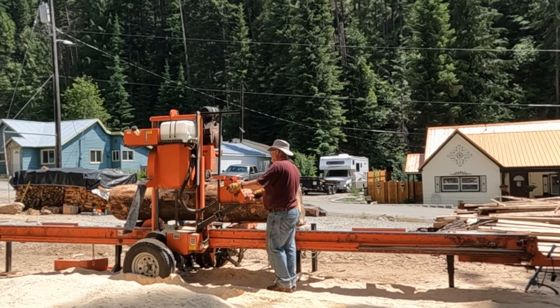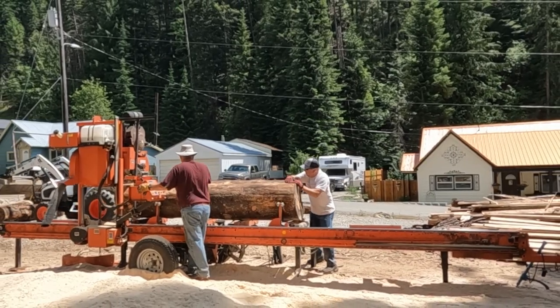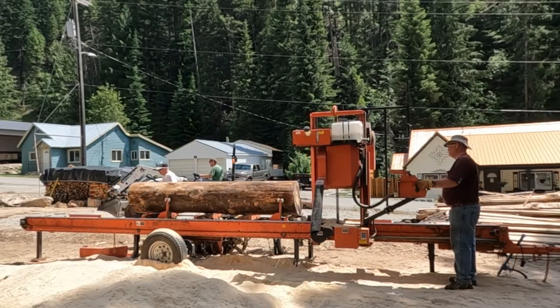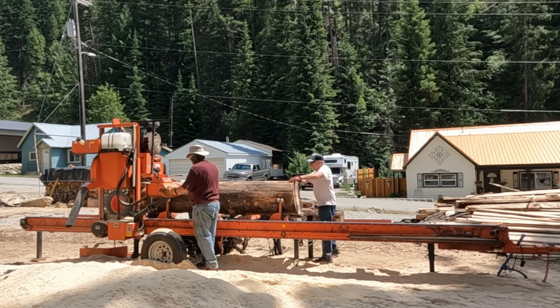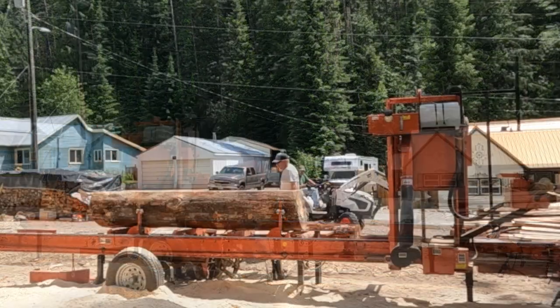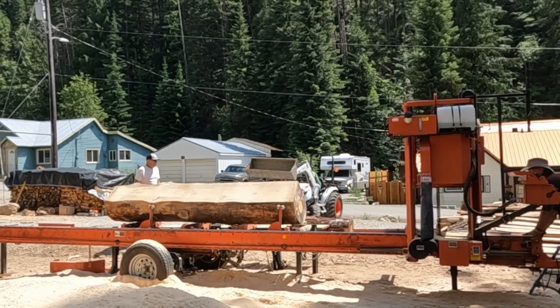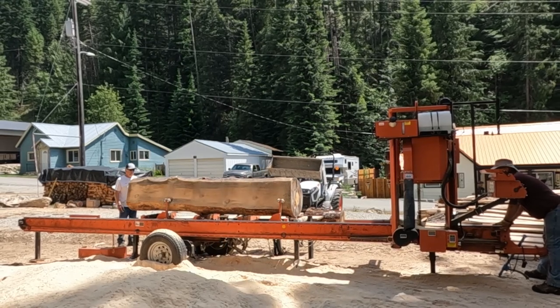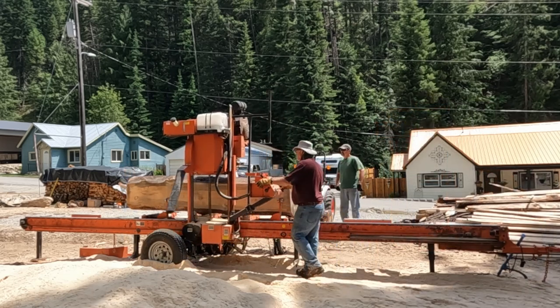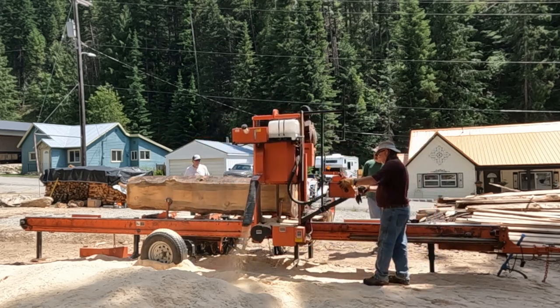Once we get this log positioned, we're going to start milling it down. Since I don't have a laser yet — that's coming — I always check the center, get an average from both ends, and that way I know where to make my starting cut. With big logs like this, one of the challenges with rolling it — whether 90 or 180 degrees — is that when you go to roll it so the flat opening face is against the side supports, it doesn't always sit perfectly. Normally it's not an issue, but on bigger logs sometimes you just don't see that it's not sitting quite right. I've been running a bandsaw mill since early 2011 — chainsaw milling before that — and if you've run one of these mills as long as I have, you can see when things aren't quite right. If you look at the log there, it looks flat against those side supports — however, you're going to see that it really wasn't.